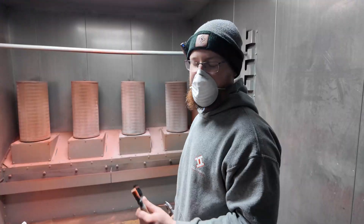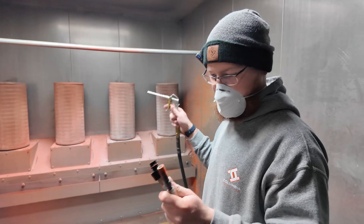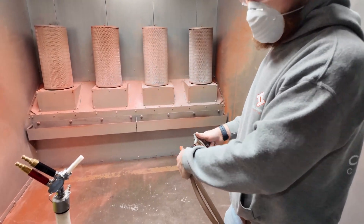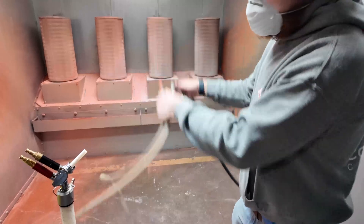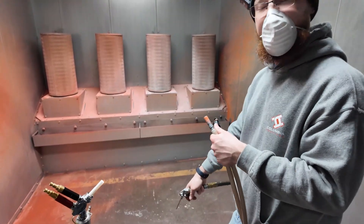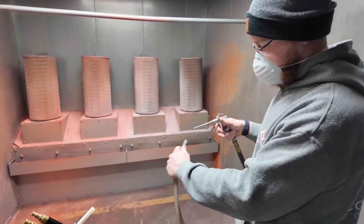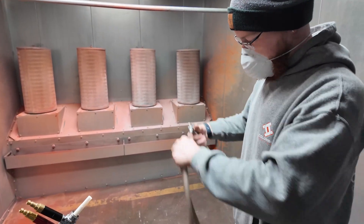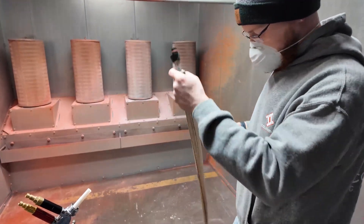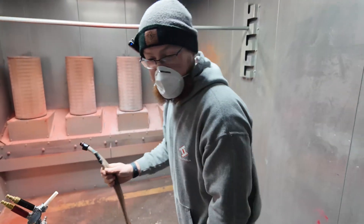For the feed hose, hold both ends in one hand and the spray gun in the other. Put one end to one side and blow, then shake it and blow again — you can see a little extra powder comes out. When you shake it, it breaks up powder in the center of the hose so you get the most cleaning possible. Do the same on the other side, and now the feed hose is cleaned enough for reassembly.